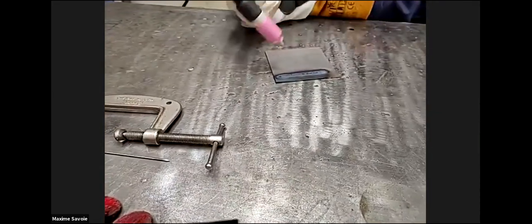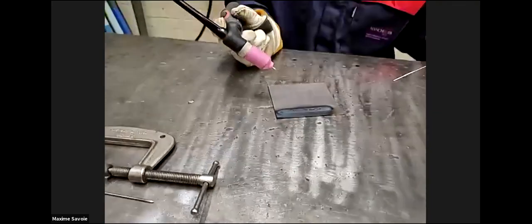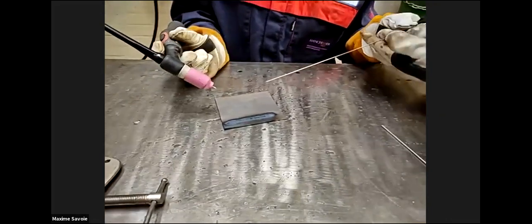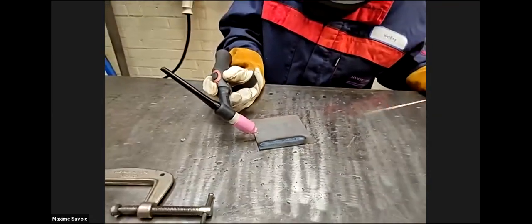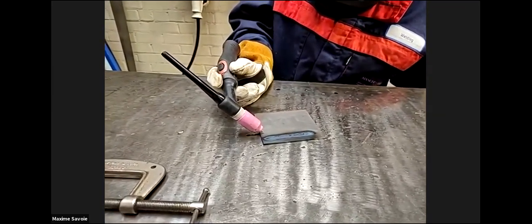Okay, yeah. Do you want to try it with the filler wire? All right, so try and maintain something about 200 millimeters, because obviously if you get it too close to the arc, these gloves are only there to protect you from the UV radiation and a little bit of heat more than anything. They're not as good. So left hand out of the way, strike up, and then introduce your filler wire. Excellent. Now bring your filler wire in. That's it, super. Well done.